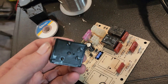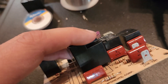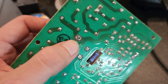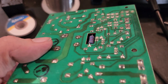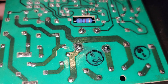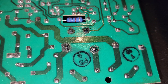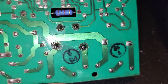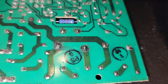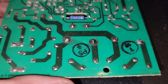We just slid the new board right in there, matching the holes where the old one was. Slid it in the holes — it fits in there real nice. We can see the new pins in there. We're going to heat the area up just a little bit and drop our new solder in. I've got the pins soldered in. I know it's not the prettiest soldering job — this is actually my first time soldering on a circuit board, but there's always room for improvement. Make sure all the contacts are connected. Our relay is nice and tight, so we'll go ahead and start installing the board.